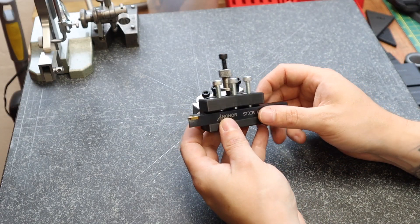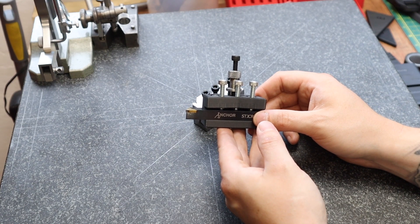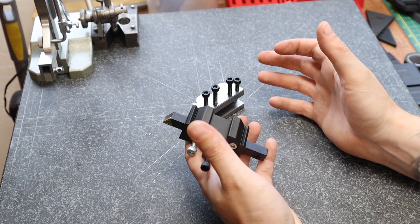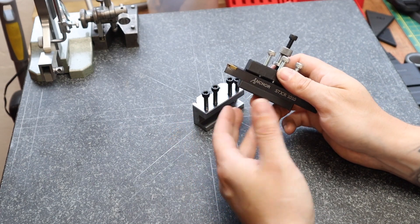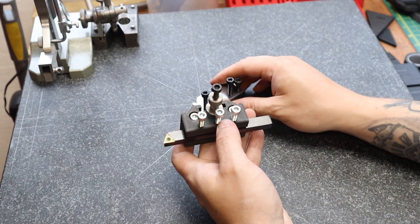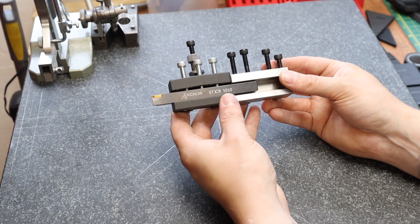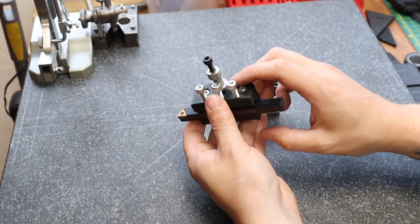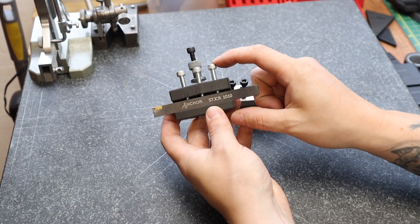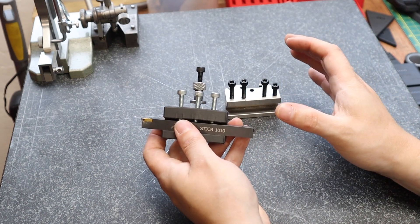After those first initial tests, it looks like this may actually be possible - using a 3D printed tool holder for cutting soft materials. The material you've just seen me cut is 6061 aluminium, and it maxed out at about 0.3mm depth of cut. For a 3D printed tool holder, I'm pretty impressed with that. But I'm not entirely happy with this initial design. Essentially, I've taken the original tool holder and made it into a 3D printed version, bulked a few parts up, and added some cap-headed screws. We're still getting some distortion when tightening the screws down, which means we're not getting equal pressure on the tool, and I'm seeing some chatter on the work.